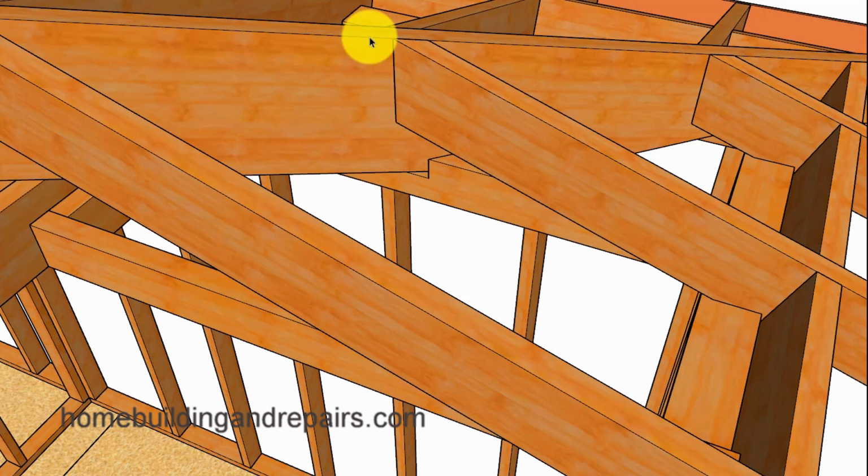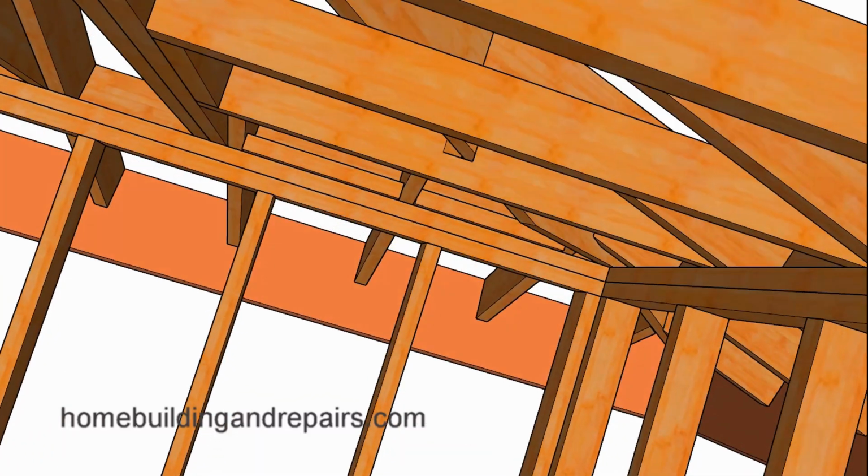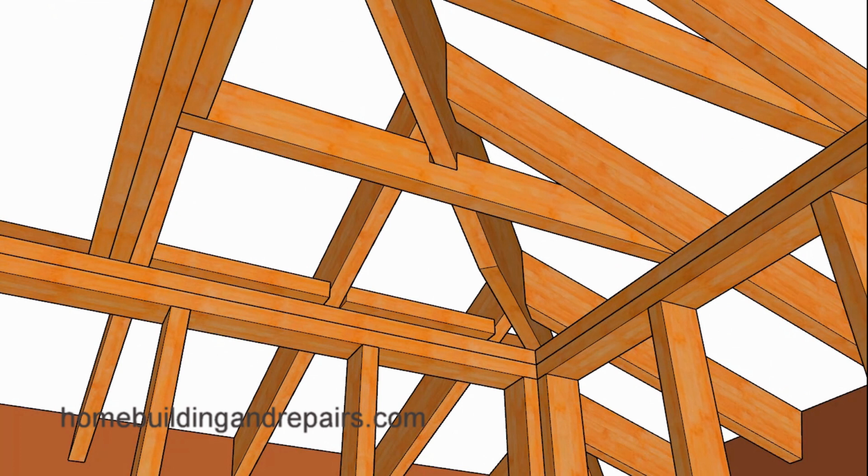And for those of you wondering why I didn't use smaller hip rafters, that's because I've already made plenty of videos like that. However, I haven't made one like this to provide you with an example of how much area here you're going to have that will not be supported, suggesting that a 2x12 might be out of the question. And of course, a view of our corner drywall blocks. These blocks will be used to provide nailing for the ceiling drywall.